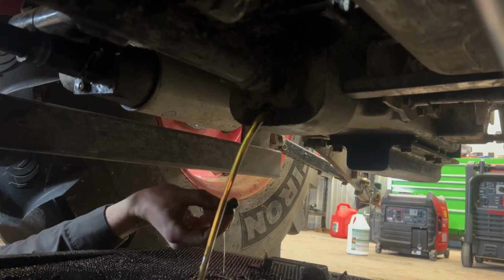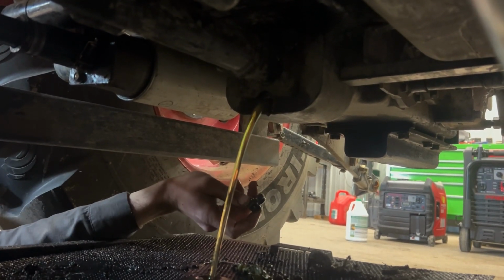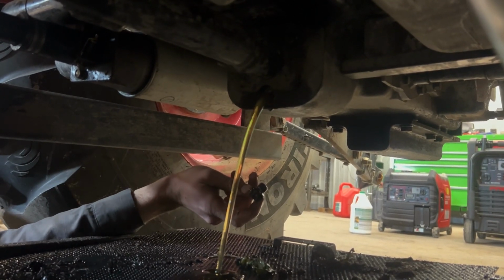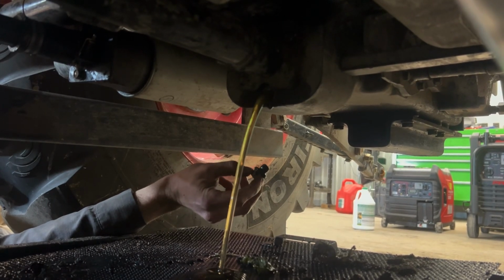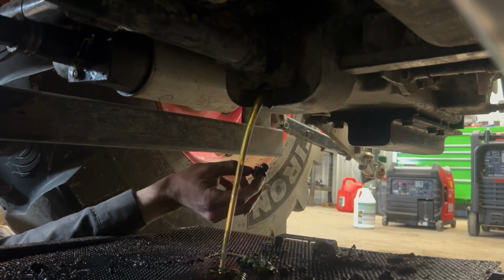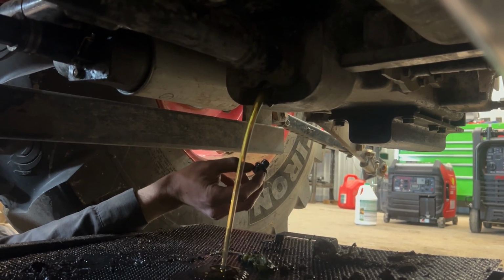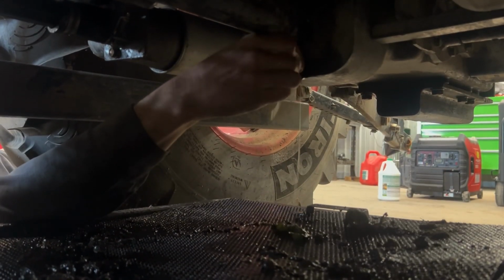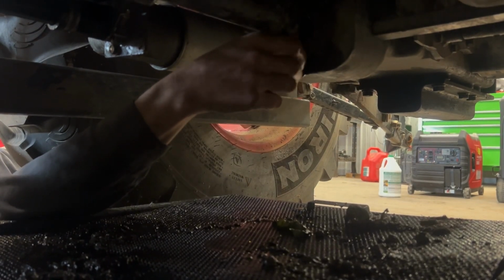There's a little bit of guesswork here, but once you pull the seal, you can drain the rest of the fluid if need be. Of course, you could go ahead and drain all the fluid and change the hydraulic filters even, but this guy had just recently had a hydraulic service, so we wanted to save him a little bit of money. We've let this drain for a couple of minutes. We're going to go ahead and put the plug back in and get to pulling the PTO seal.